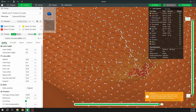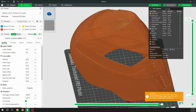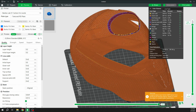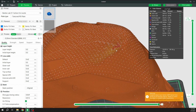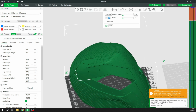You will see those rings as a printer prints, an FDM printer. Okay, it's going to slowly build up. Okay, like that. And if you opt for speed, you're going to notice those rings a lot more than if you were to do it the other way. So again, this is the quickest way. It only takes a day and 52 minutes, and it costs about $10. So let's go back. Okay, and let's opt for a small radius and high quality and smooth.